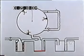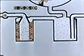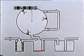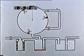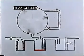The whole of the sphere is now scoured with air drawn in at the top. The extracted air is sterilized by passing through the vent heater. Any liquid effluent collects in the bottom of the receiver. The sphere is sealed and sterilized by passing in steam to maintain a temperature of 100 degrees.